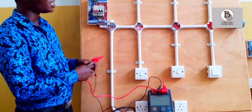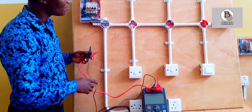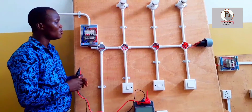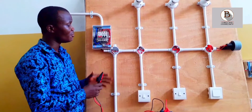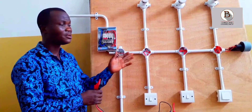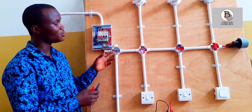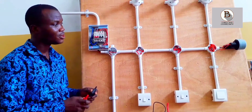As we ensure that there is no possibility of leakage between any two cables, we also have to bear in mind that in the circuit we have several cables running. For instance, we have the live wires — the live wires that carry the electricity power all the time. Then we also have the neutral, and we also have our circuit protective conductor.